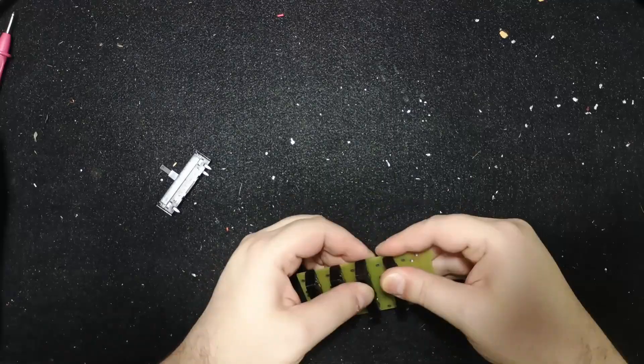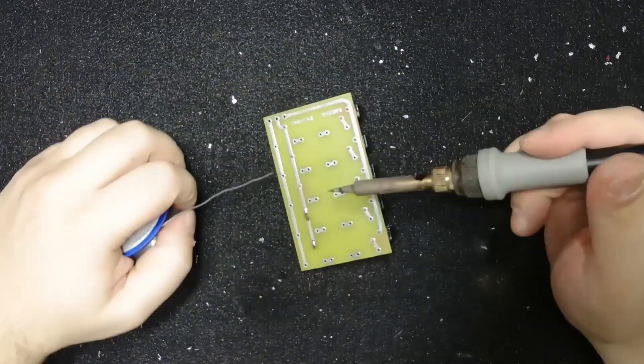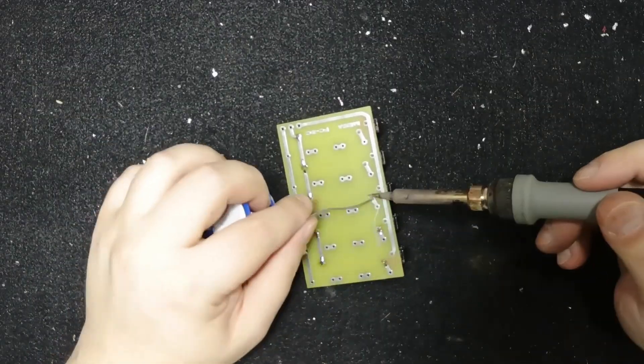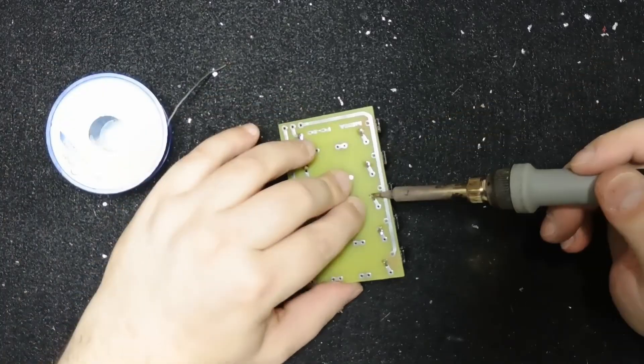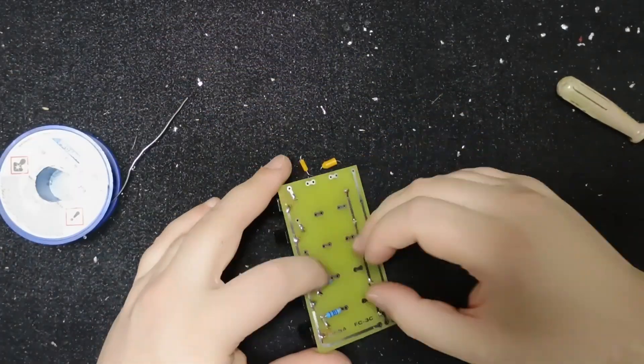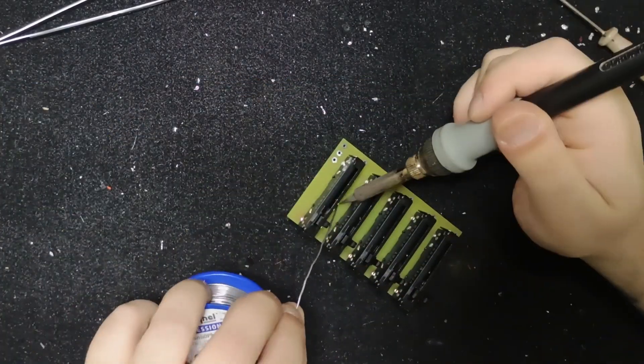Here's the double-sided PCB for the sliders. The circuit here makes up the five-band RLC filter network. Each slider corresponds to a fixed center frequency and Q, defined by a resistor, an inductor, and a capacitor. The slider pots adjust the gain of each band, and the cut and boost range is determined by the active circuitry on the driver board.